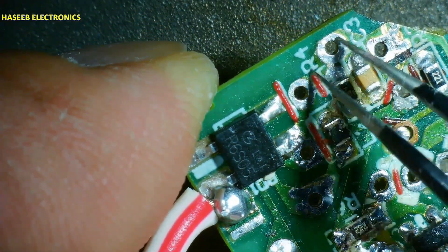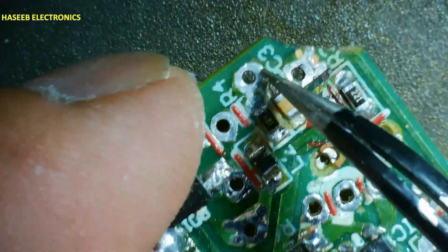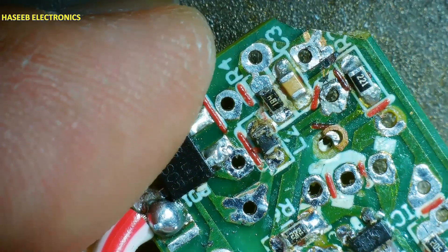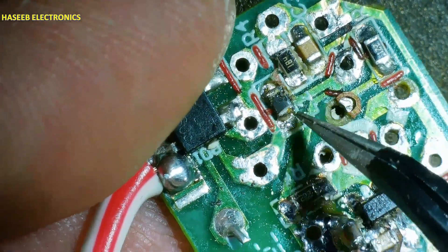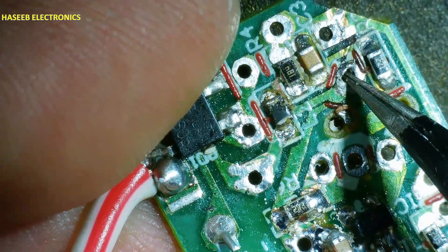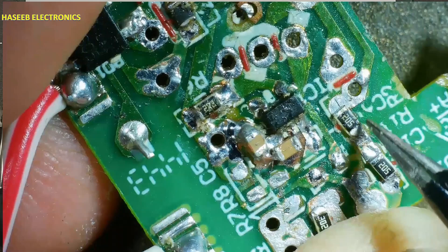This positive is reaching to this component — L1 inductor, 46 micro-henry. Then this positive voltage will reach to the second capacitor; it is also a 4.7 microfarad 400-volt capacitor. But the negative side is reaching through this SMD inductor (black color inductor), so negative will reach to this resistor, this capacitor, and this resistor. These three components we will discuss later.